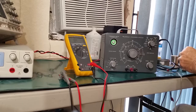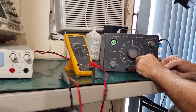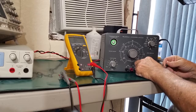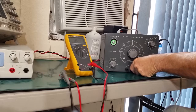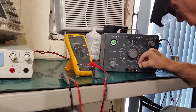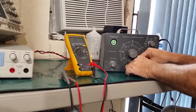Let's check a 2.2 microfarad. So on that we go to the 0.1 to 50 scale, which is this second set of scales. So 50 would be way over, oh wait, we're looking at 2.2. 2.2 should be somewhere near the middle there. Since it's an electrolytic, we put the negative in the right hand side, positive in the red. I'll have to make a couple of clip leads for these to make this a little faster.